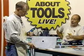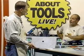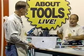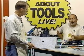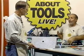Correct. You can also do a series of holes with the larger plug set to replace a line that's cracked. And these are available in two sizes, 25 millimeter and 45 millimeter. 45 millimeter is great for sinkholes. And we also carry one by Velopec that's even larger. I believe it's 1.5 inches in diameter, but I would have to check to see.